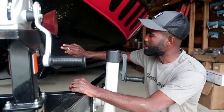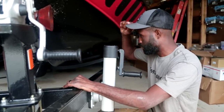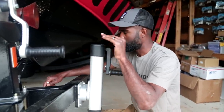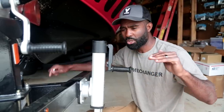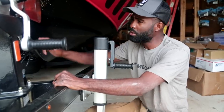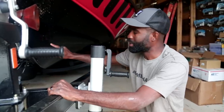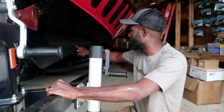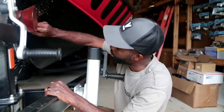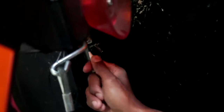The next thing you've got to do is make sure your keel shield is positioned six to nine inches above your water line. It's actually good that I've got a little scum line here because I want to go just above that. You don't want the top of the keel shield to rub against the bottom of the lake or shoreline when you beach the boat, and you don't want the front to rub against the roller when you trailer. I'm going to put a crayon mark to show where to position the keel shield.